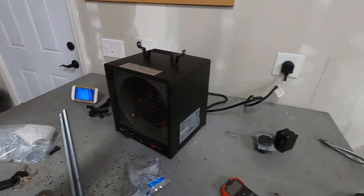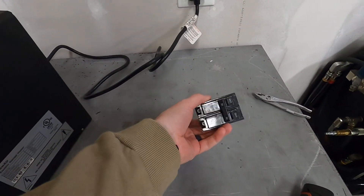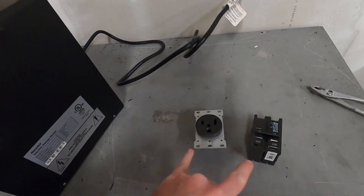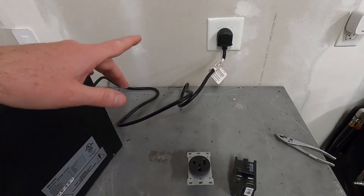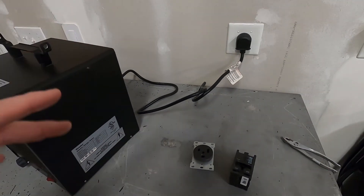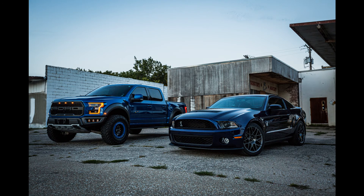We got that outlet and breaker swapped over. Got my heater running. Old outlet, old 50 amp breaker — these things are still good, so I'm going to hold on to them. Eventually I'd like to do a mini split in here, get rid of this heater, and put my 50 amp back in so I could run a welder or anything like that. If you found this video helpful, I'd really appreciate it if you hit that like button and subscribe to the channel. Drop down in the comments what you'd like to see next, what kind of projects you have going on, and if you have any questions about swapping over a 240 outlet and a 240 breaker. See you guys next time.